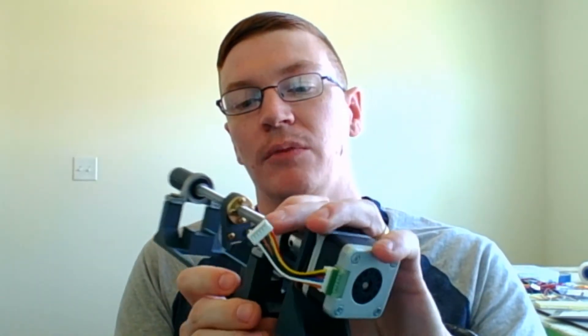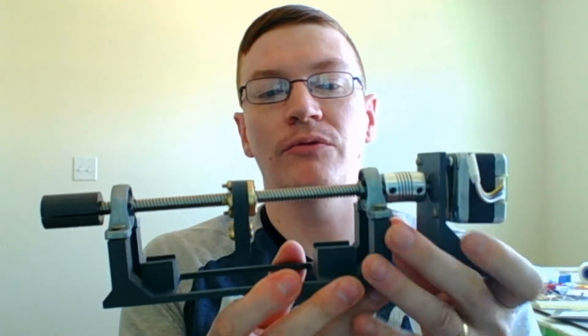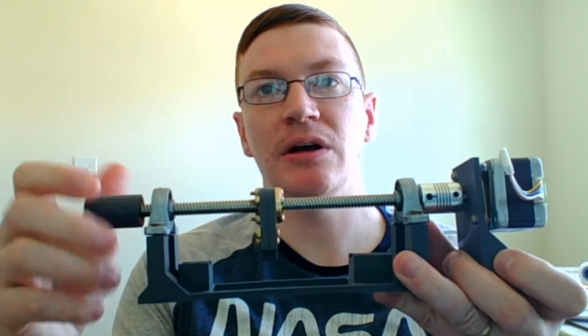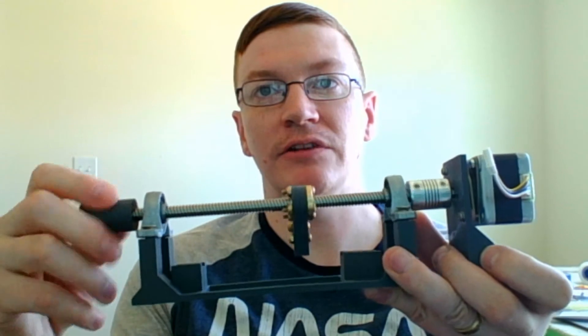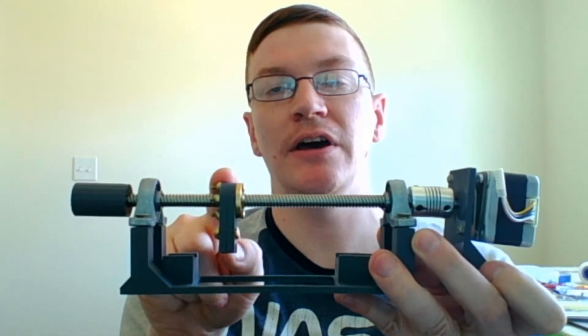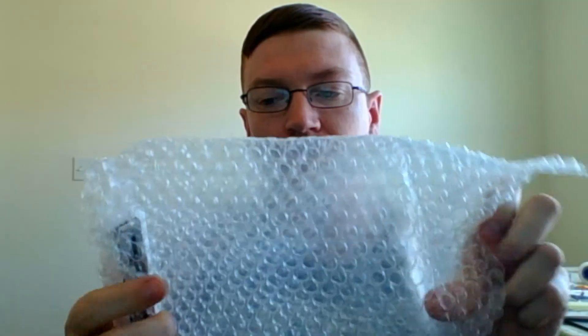Here are the 3D printed parts all assembled. As this motor rotates, this is the nut that I told you would slide back and forth and basically actuate that linear 10k potentiometer. Depending on how many revolutions of the motor have been completed, that nut traveling left and right is what's going to tune that circuit or basically give feedback for the linear position of this nut. Based on its linear position I'll have a different resistance value from the 10k potentiometer — and I just got these in the mail here. This looks like it's probably the 10k pot — yes, there it is, the 10k potentiometer I'm going to use in that circuit.